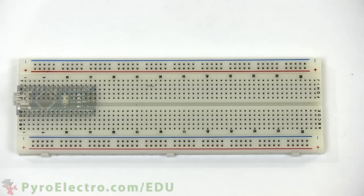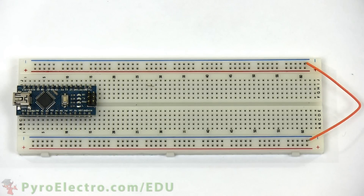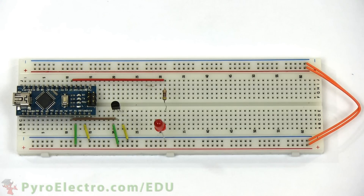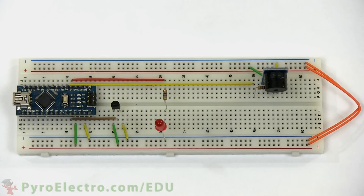To build the circuit, place the Arduino Nano into the breadboard and connect its plus 5 volt and ground pins to the breadboard bus lines. I'll use two orange wires to connect both bus strips together. Next, connect plus 5 volt power, ground, and analog pin A7 to the temperature sensor. Then connect digital pin D2 to a 470 ohm resistor, which then connects to a red LED to ground. And finally, connect digital pin D3 to a 470 ohm resistor, which then connects to the input pin of the buzzer alarm. The buzzer alarm also requires a plus 5 volt and a ground connection.